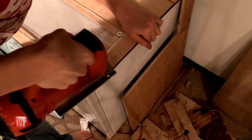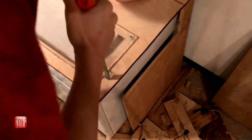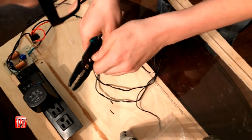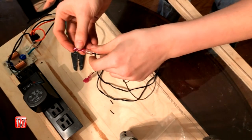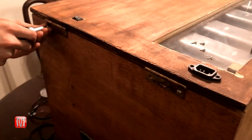Towards the bottom left corner, cut out a hole to install a power cable plug, then file the hole smooth. Once the plug is installed, cut out another hole halfway up the same side — this is where we will mount an on/off switch. Wire the power switch to the outlet strip, which will be mounted on the back a few inches from the top.